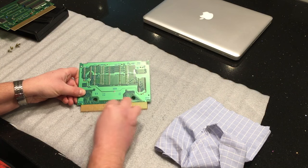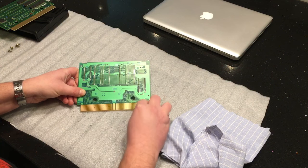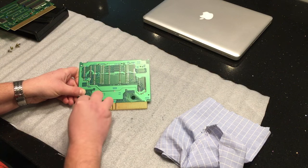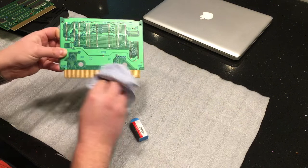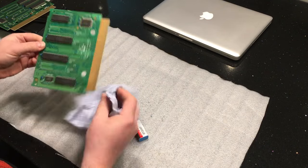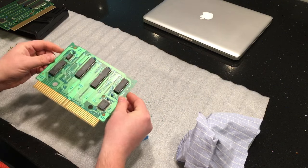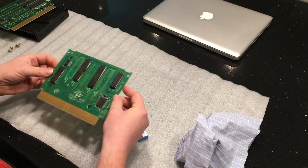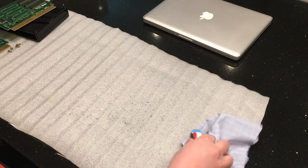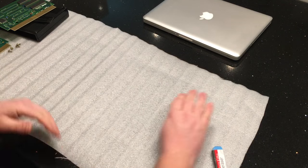What you don't want to do is touch it after you've cleaned it, because you're just going to put oils back on. While I'm not wearing a wrist strap, I am trying not to touch the chips — it's probably best not to damage them. There are lots of thoughts about this: some people say it doesn't make any difference at all. I believe it may reduce the life of the chips, though I've not actually seen anything blown personally.